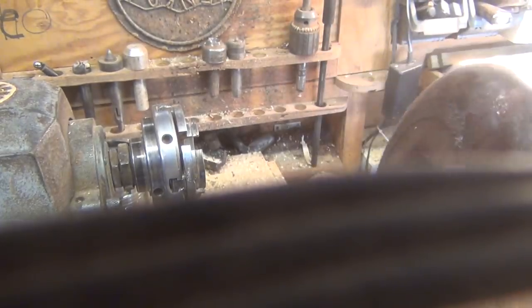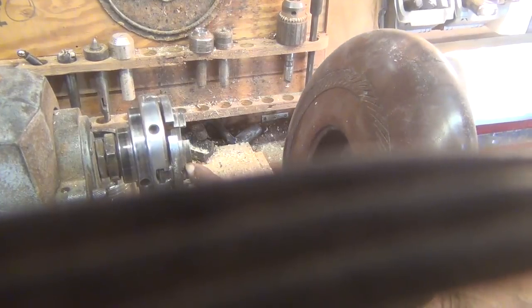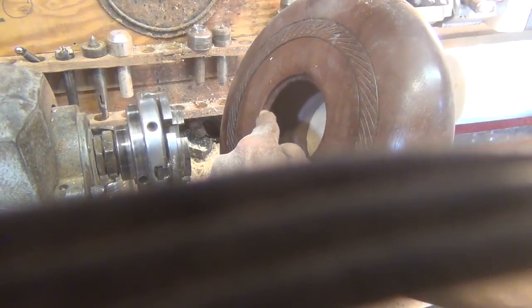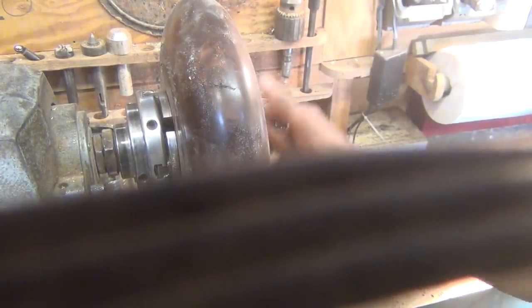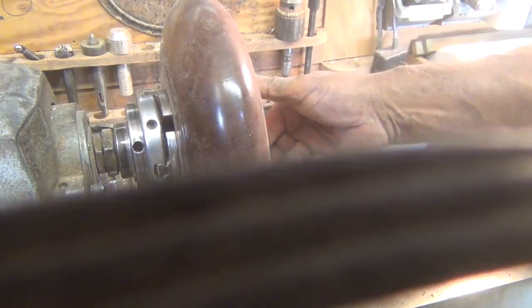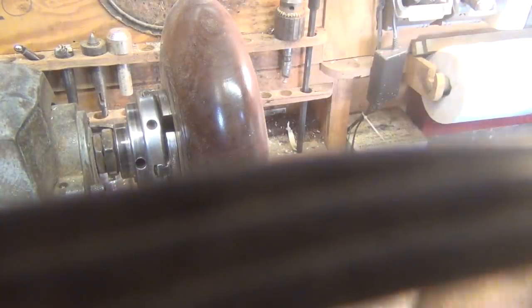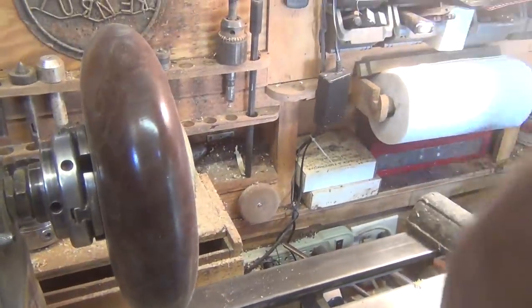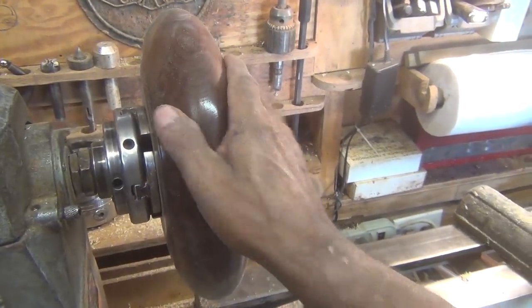So instead of the traditional setting it up to this little groove that's over here, which is the back of your thing, and because I got this and I don't want to sit it just over here till it bottoms out on the outside, I'll put the whole piece in nice and flat and tighten it up with the piece against the back shoulders of my chuck.